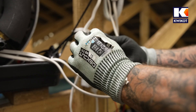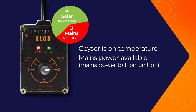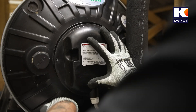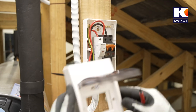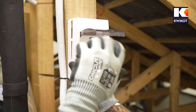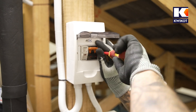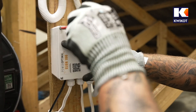Now that we have finished commissioning the system, we turn the Elon control dial to its number 3 setting. Number 3 means the system will use solar during the day from early morning until late afternoon, and top up with grid power at night. Everything has been tested so we start closing up the system, replacing the covers and screwing them in place. The box has been fitted horizontally to ensure that moisture flowing down from vertical cabling does not seep into the box and cause damage — moisture will stay inside the conduit. The Elon box and DC box installation is now complete.